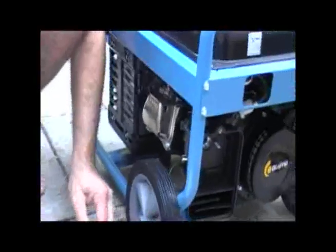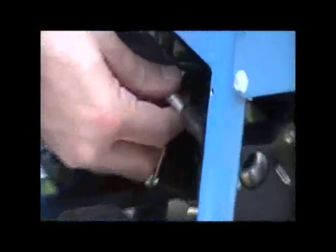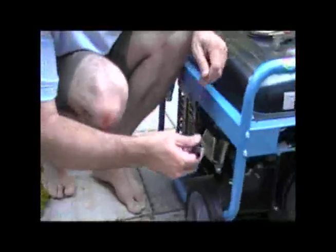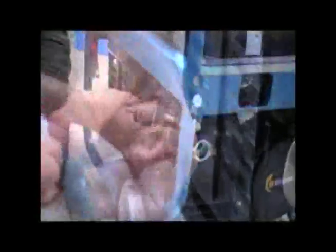Note that as we're putting the air filter back on, the hose is now too short. So what we have to do is cut it in half. The kit comes with a hose extender, so we cut the hose that came with the machine in half and put the included hose extender on — and now it's going to fit. It comes with two zip ties to hold it in place. This pops back in here and then goes into the hole of the air filter.